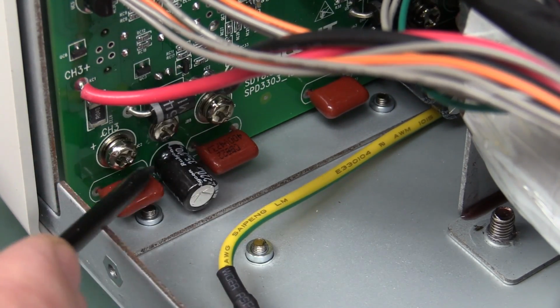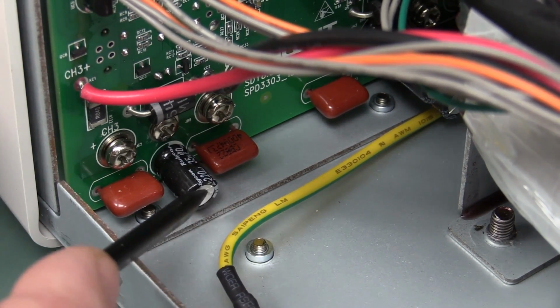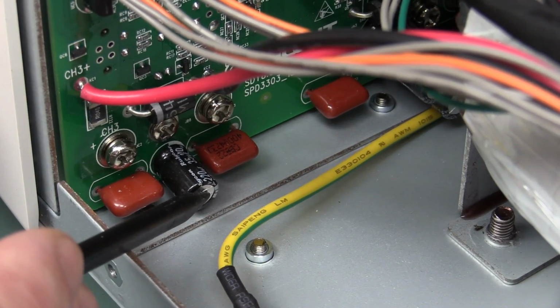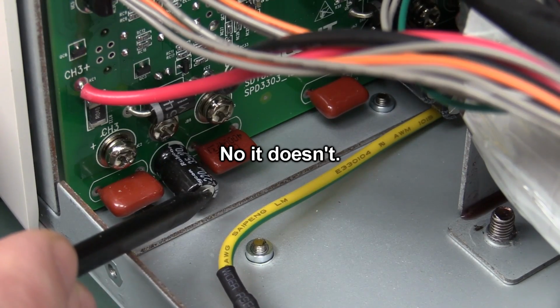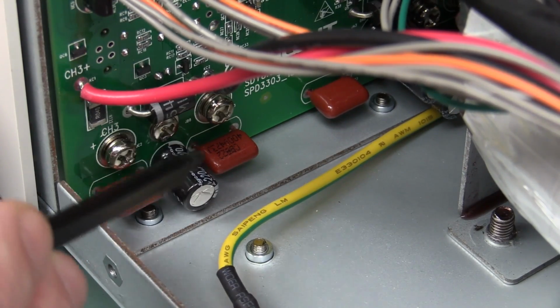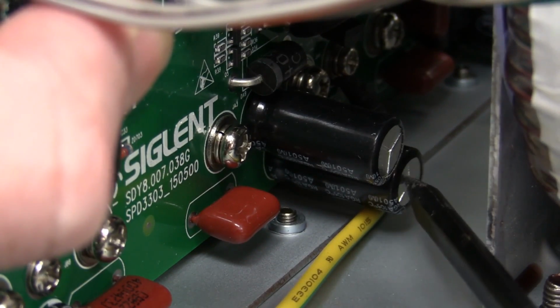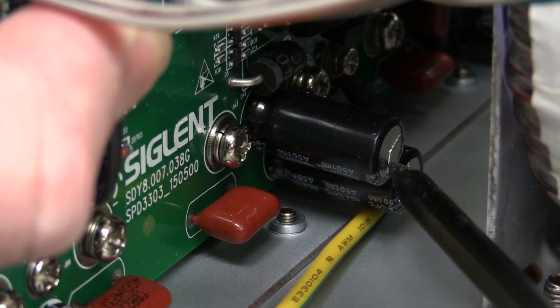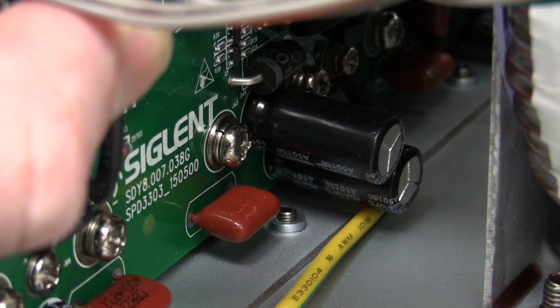So there's the third channel, for example, which is the fixed voltage output. Well, that one doesn't. Yeah, that one would have a current limit, I think. I don't know, I haven't actually tried it. Anyway, small amount of output capacitance, but once again, that one is a Rubycon. But there's an output for channel 2, and these are not Rubycon caps, so these are Lelons. So, yeah, there you go. They've actually got a fair bit of output capacitance there.